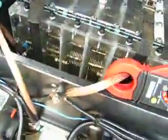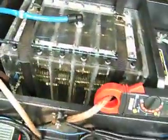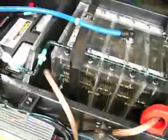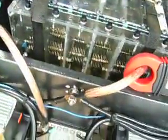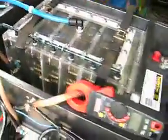And notice that all the electrical connections are below the water line on this cell because we're running such high current. Okay. I don't want any chance for any kind of sparking, and this is also a Bob Boyce type of protocol approach where all the connections are made underwater, so there's no arcing of any kind to prevent unwanted explosions. Because this thing is putting out quite a bit of gas, and even though the water level's right up to about here, there's about a liter of gas there. If that goes off, it'll blow the top of the cell right off.